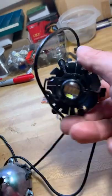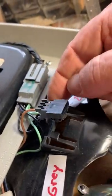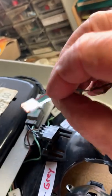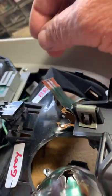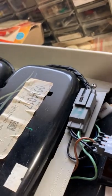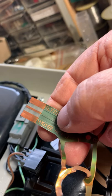Now I want to do the other one just like that. Then I want to somehow connect the wires to this. This was the original connector - it was snapped into this holder right there. It had this ribbon cable - this is just a flexible Mylar circuit board, basically. It's got copper traces on it, and what that did is it slid in there, made contact, and then distributed it to those lamp holders. The heat and changing the lamps damaged these, and they just kind of fell off. So I was going to solder these wires onto this right here, just trim this off, scrape off the coating, and then solder the wires on there.